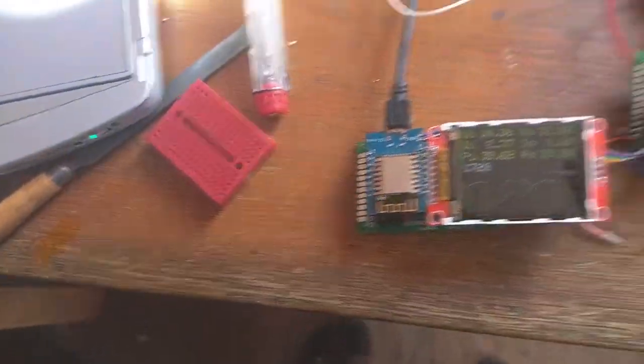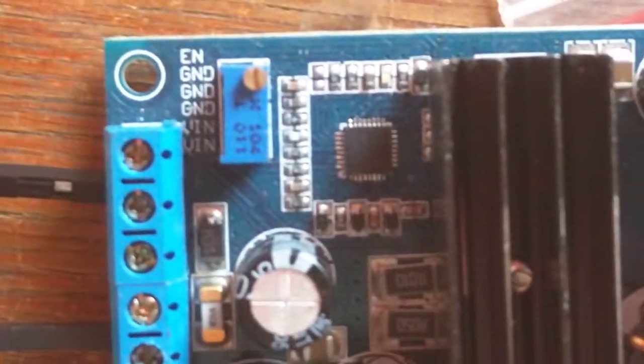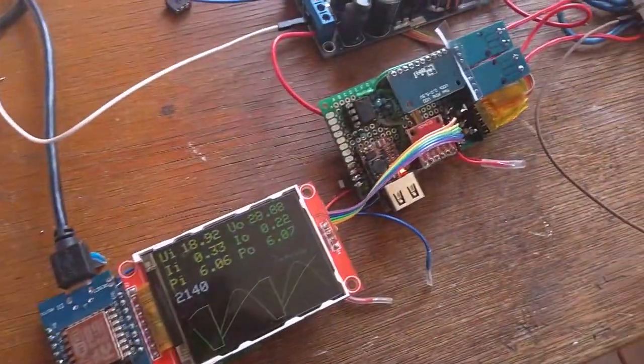The resolution isn't as great as other SLA printers — about 0.1 to 0.15 millimeters compared to 0.02 on high-end machines — but you don't really need more than that. These lines here at 0.2 millimeters would be enough. I have an idea to turn this 3D printer into a PCB maker, which would definitely be a great Kickstarter campaign. The more people who like this idea, the more motivated I am to continue.